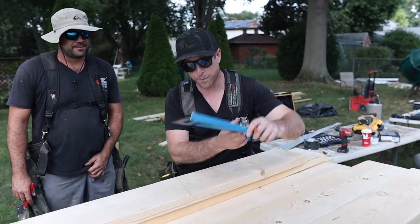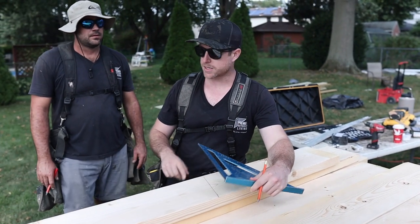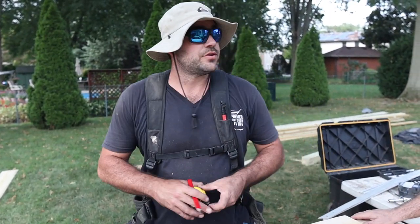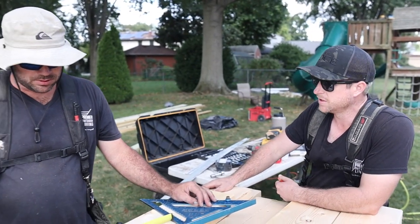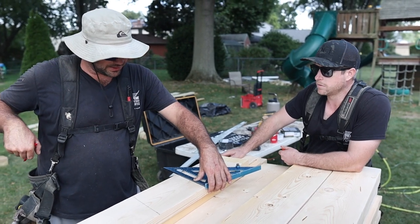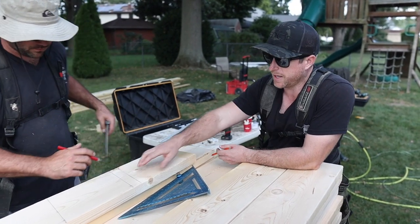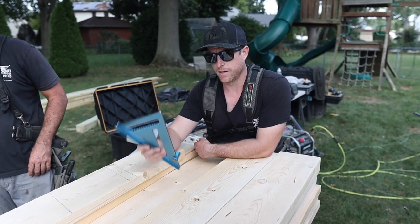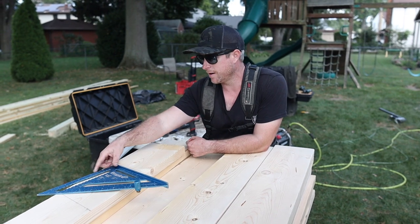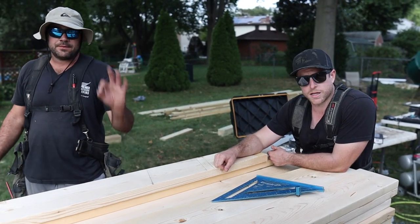So now he's got it on his 4 pitch still — you're going to leave it on there, because that's what the roof is. We got our mark here and we continue this line down right here — this is going to be where our bird's mouth is. 12 inches in on my wall, another inch and a half for fascia — fascia is a 2x6. Now he's using his speed square, putting it so we want a 90 degree cut off of that. You're really just working in 90 degree increments here. This is on our slope, so when we pull 90 off of that, once this goes up in the air, that's going to be level with the ground. Plumb cut, level cut, baby.